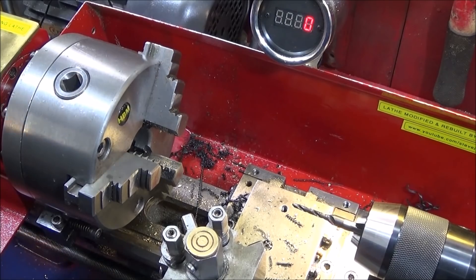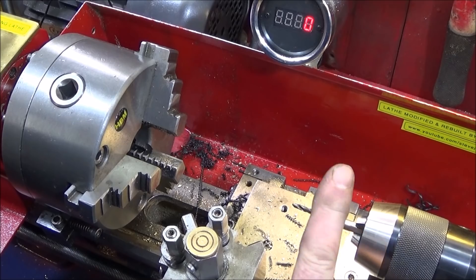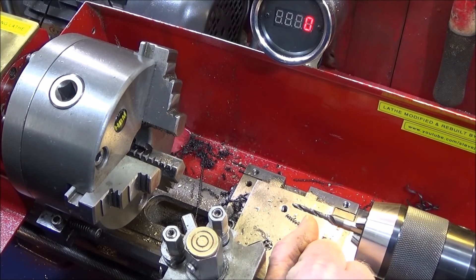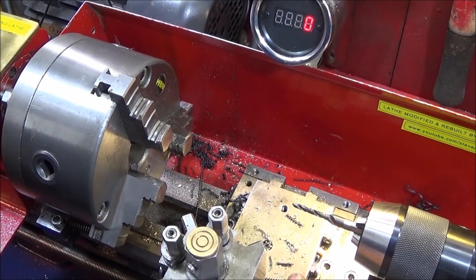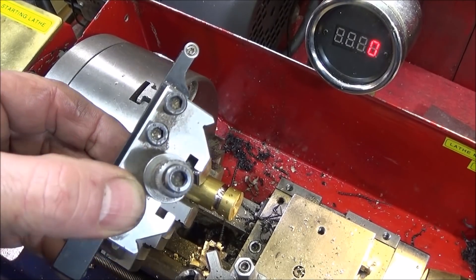When I say smaller ones I only mean going up to about 6 millimeters in diameter on the thread. It's not that there's anything wrong with the tool, but after 6 millimeters it becomes hard to actually push the tailstock in on the drill and pick up on the thread while controlling the lathe at the same time. Plus, when you go into reverse with the larger drill taps there's a tendency for the chuck to undo and the tap to spin in the jaws.